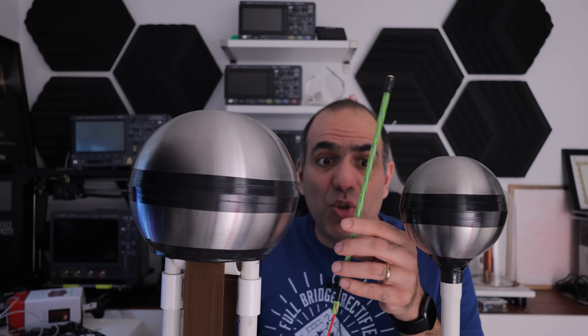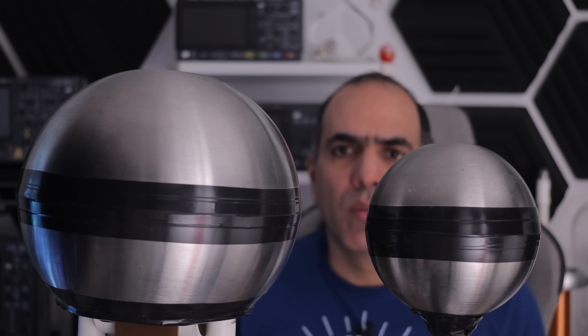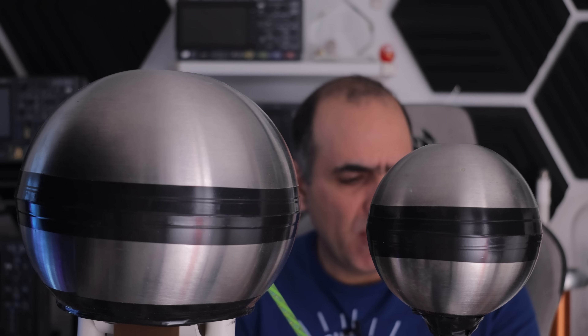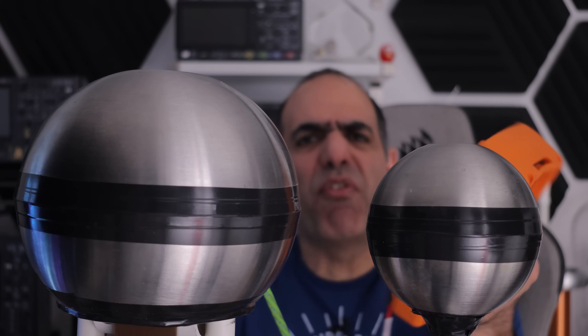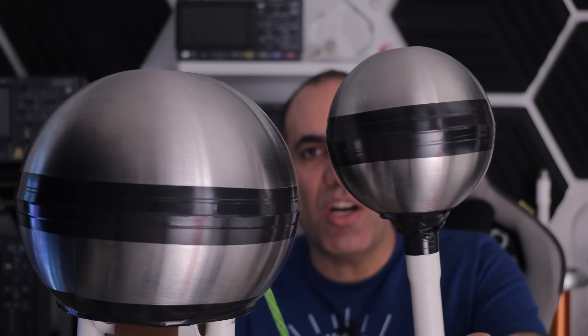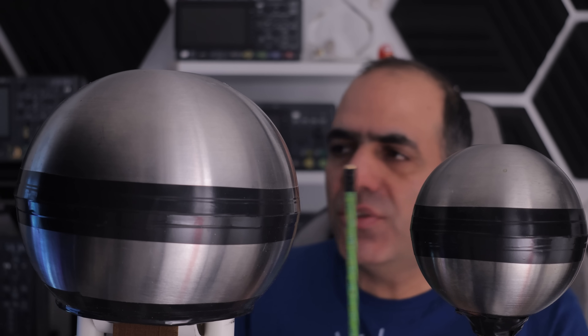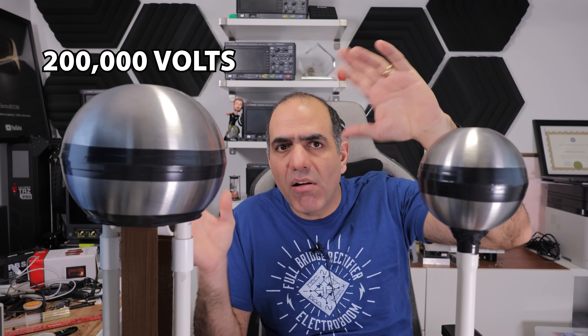But let's see if my resistor divider will do any better. Will this massive resistor load and drop the Van de Graaff voltage? So now if I touch the Van de Graaff, it stops discharging, and I'm reading only around minus 0.4 volts — it's like minus 4,000 volts. So it's not gonna even discharge in like 2 millimeters, very small arcs. Even my 2 gigaohm resistor is enough to discharge the voltage to close to zero, well, 4,000 volts. From that observation, perhaps the 200,000 volt estimate from the big ball gap test was close. Perhaps the ball test is the way to go since it allows the voltage to rise to its maximum before it discharges.